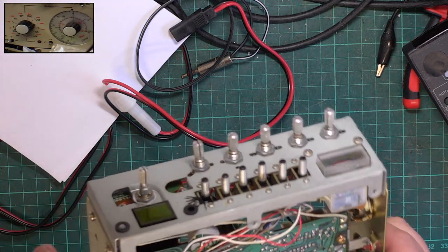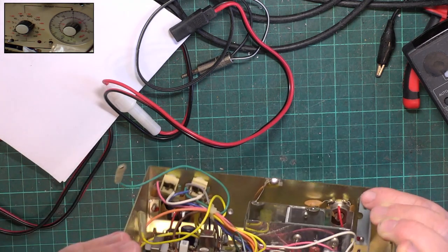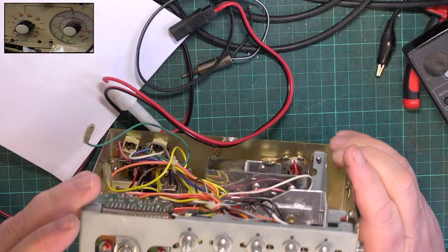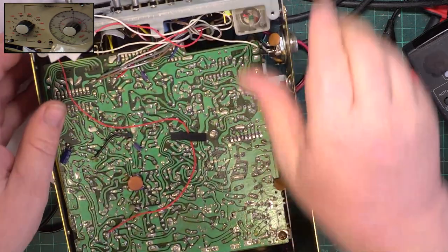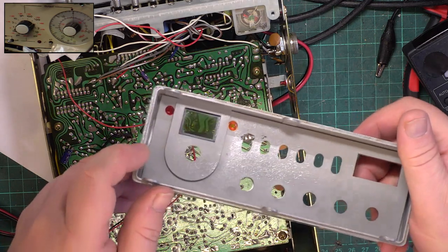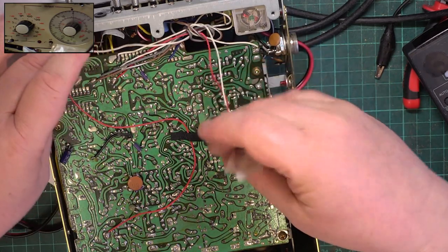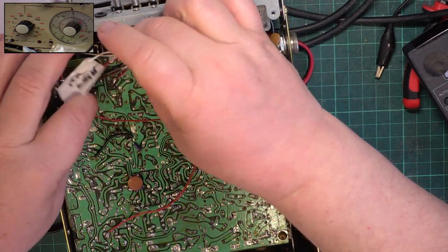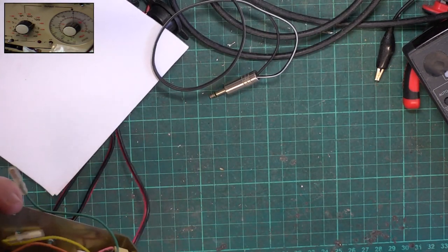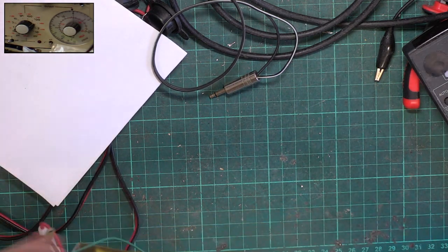So they've removed the receive lamp. We can do that. We've got lamps in stock. I think they're just white lamps, aren't they? They're white lamps behind a coloured bezel. So that's fine. So we'll just put a normal white meter lamp in that position. And then Bob's your uncle. Hopefully that one. I didn't look whether that worked. And I think we'll do that, because I don't want to have all this front off and then we've wasted our time.